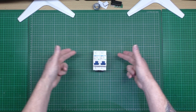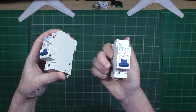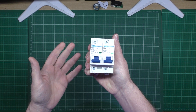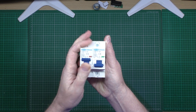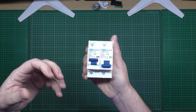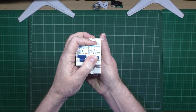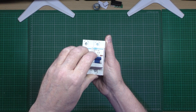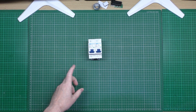Anyway, these are the circuit breakers for version 3 — 125 amp circuit breakers, two of them. I've got to do it this way because I can't find a 300 amp circuit breaker. I'll have one for initial fire-up where all the electronics come on, because the surge will only be around about 30 amps. Then for running I'll have both of them enabled.